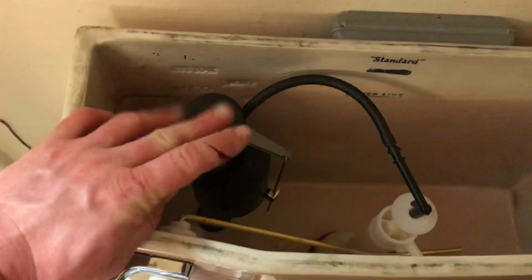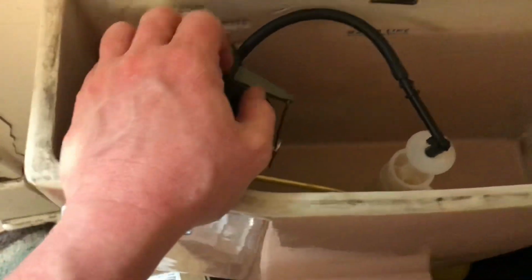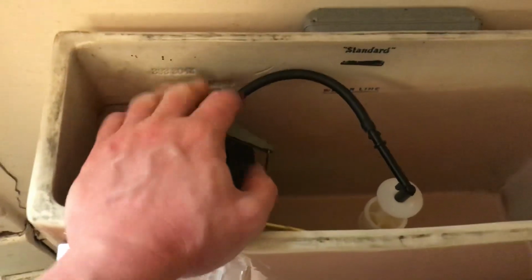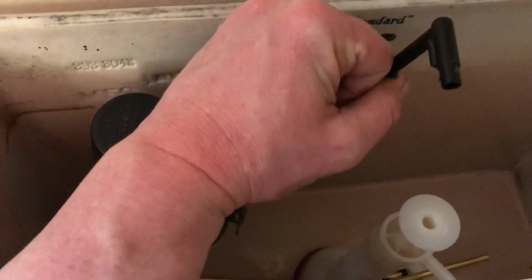It sounds like a Mansfield. Well, we've installed the 210 flush valve in it, and we still have the 400A valve in it for right now. This is a 1980s, I'd probably say early to mid 80s 400A. It works perfectly fine. It's cleaned up and the seals on it are good. You can tell here's the original style angle adapter, which, sorry about the cut on my hand, happened at work weeks ago.